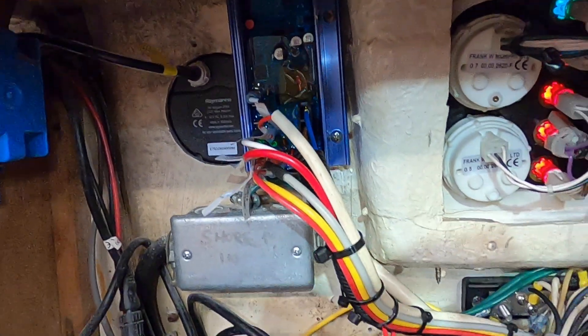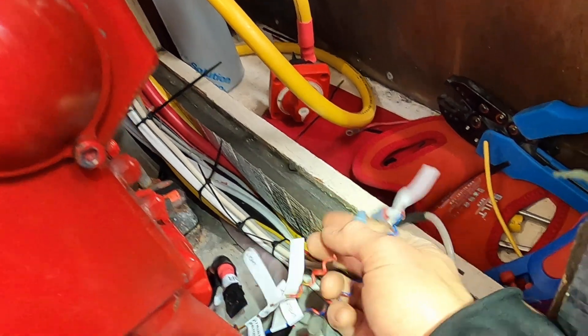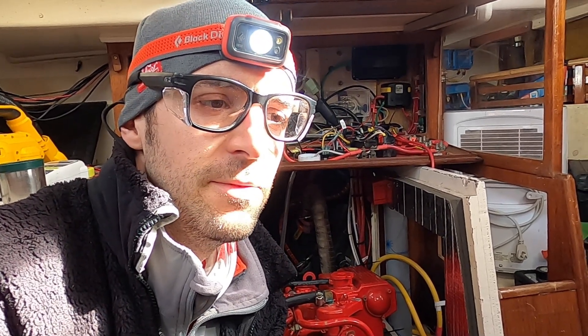Just finished up wiring the new voltage regulator. All these lines have been run. The last things I wired up were these two wires left over from the old alternator. Through a little Google research, I was able to decipher what they were and label them — because labels are our friends. They go into the engine harness that connects to the engine dash. That was probably one of the more scary and confusing parts of this project — blending the engine with the new charging regulator can be a little intimidating. But in my experience here, it boiled down to being more basic than I originally thought. There's no reason not to tackle whatever project you're trying to do, because the tools and knowledge are out there. So just go forth and conquer.